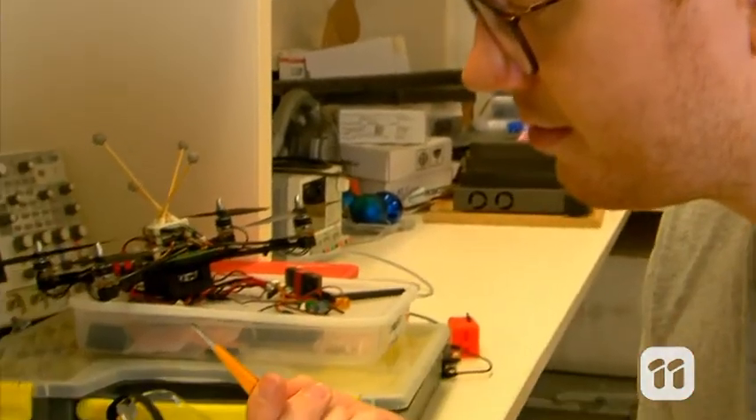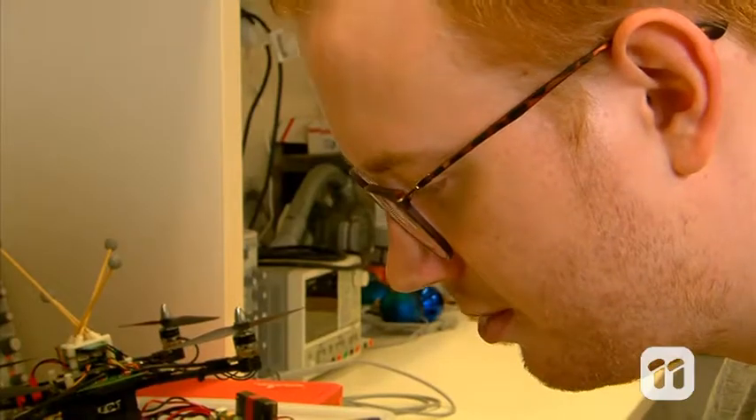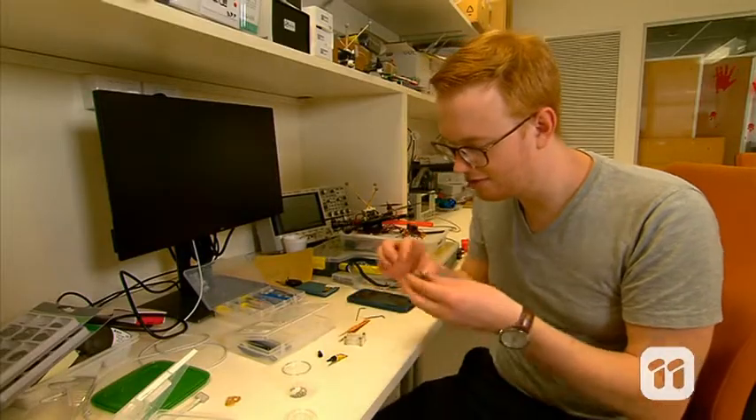So I had to build my own sensors — ones that were sensitive enough to measure the delicate forces acting on the rotors of a UAV. To get started, I needed a few of these. Mobile phones use tiny barometric pressure sensors to measure the atmospheric pressure and help your GPS tell what altitude you are at. I took these sensors and covered them in a sensitive rubber material so they could pick up on the movement of rotor blades.